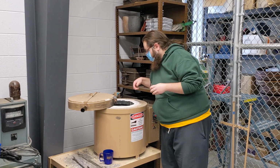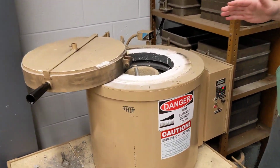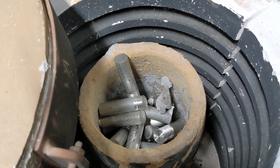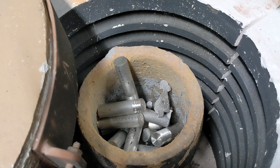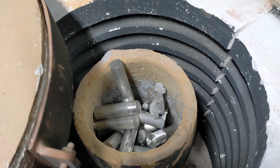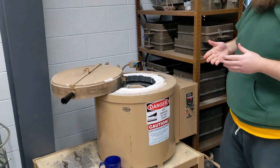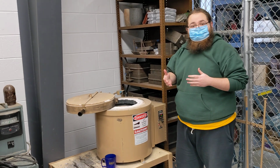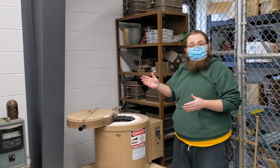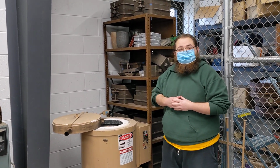So I suggest roughly around this amount of material for now. We're gonna let it melt down. There's a lot of air pockets in it. It'll eventually probably reduce to about half to maybe 3/4 of what is actually there in volume when it liquefies fully. And then later on, we'll keep eyeballing it. If it's not at our desired level, then we'll keep adding material as we need. And that is pretty much it for the filling up the crucible.